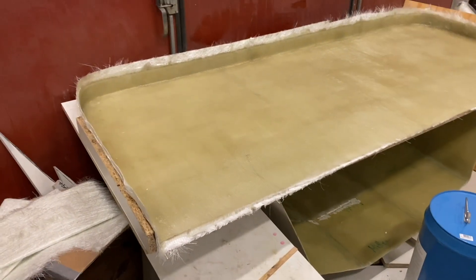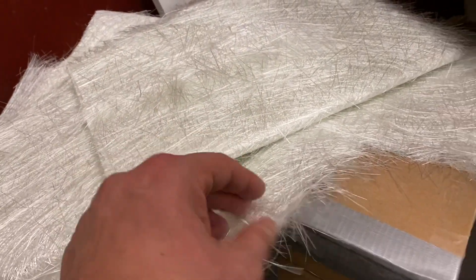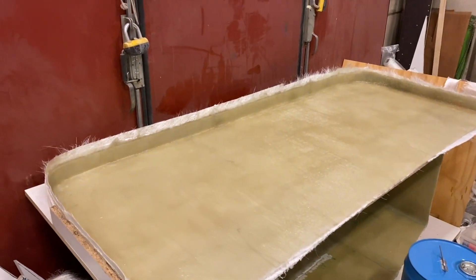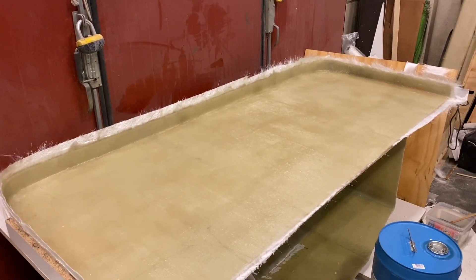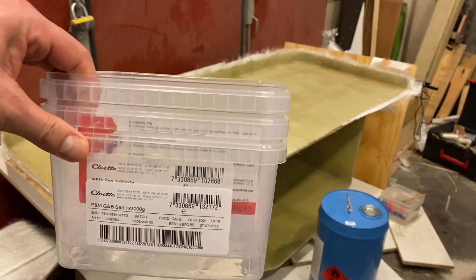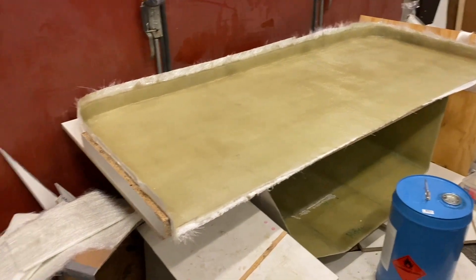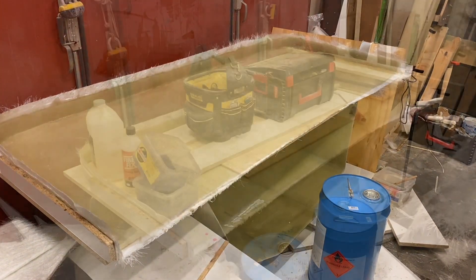The first layers are done. Now all four layers are complete and everything worked out well, but it was a bit stressful fiberglassing the sides in the corners because it tended to harden quite quickly. I wanted everything still wet when I laid down each subsequent layer so it would bond together. I usually work with plastic boxes from local candy stores — they'd otherwise throw them away, but they're really good for weighing and mixing resin.